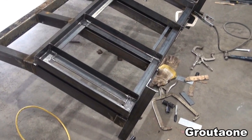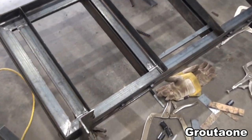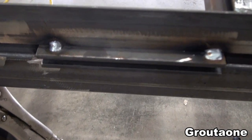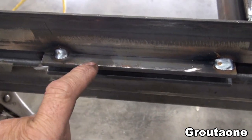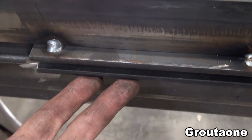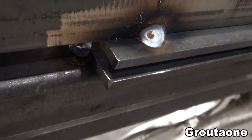This is my second attempt at making hinges for the swing-out ramp on this trailer. I've got a little bit of work done already, but I'm a ways off from testing. Previously I did not have this plate spot-welded in place. There's another one on the bottom and I'm doing a similar thing over here.